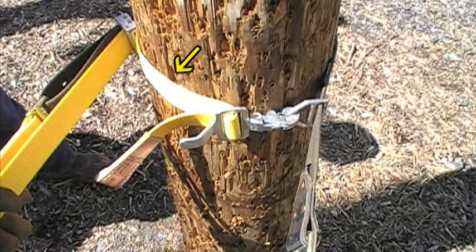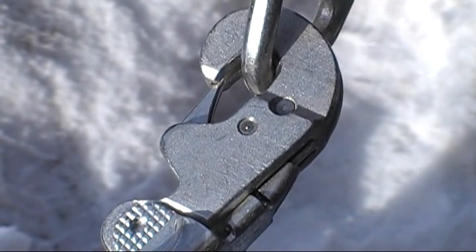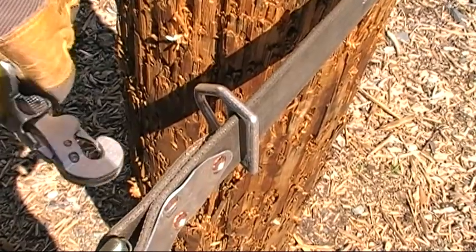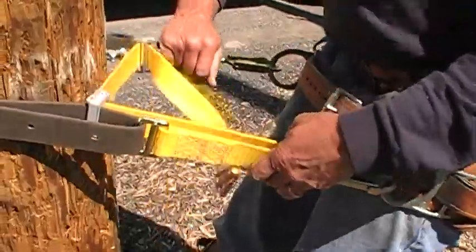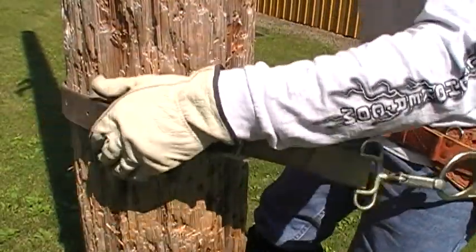From the PC roller, the yellow material passes through the ejector snap, which has two distinct functions. First, it completes the connection around the pole by linking the D-ring to the brown material. The snap hook is unique in that it can be operated when there is tension on the strap — simply pulling on the lever-action gate forces the D-ring out of the nose of the hook. There is no squeezing, just a pull. Reconnect by hooking the snap into the D-ring. This hook has a friction adjuster with a handle that allows you to lengthen or shorten the yellow strap. This is not the only way to adjust the length of the yellow strap; we will soon look into a couple of other ways.